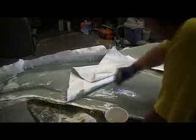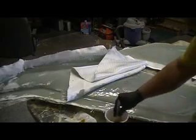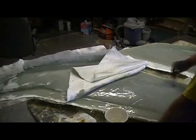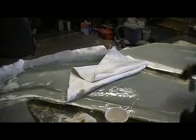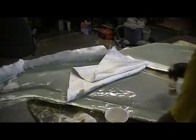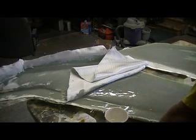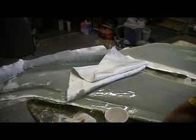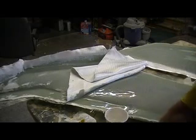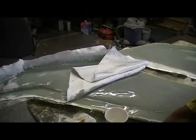There's a bunch of resin down here. But if we get this cloth mostly wet from the bottom, it won't trap any air. That's the problem I was having when I put that second layer over the top and then doused it with resin — it's like putting a lid on a bottle. It traps that air in there and it's really hard to work it out. It don't just come right back through the cloth once it's saturated. That's why I had so many bubbles on my fuselage. I should have done it like this — just really layer on the resin.